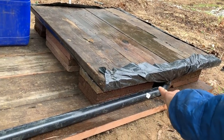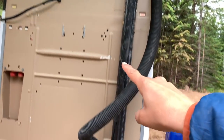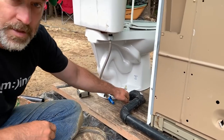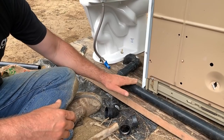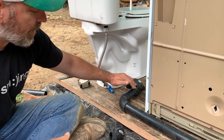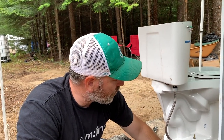So we've got the shower hooked up here and it's going to flow down this pipe. Then we've connected to the washing machine. Then it comes down here and goes uphill a little bit before it goes down into the septic tank. That is so cool. We did that so this is going to form - it's going to substitute for our p-trap. That way this pipe right here will always be full of water and the sewer gases when they come up can't escape out into the bathroom - they'll be blocked because this will always be full of water.